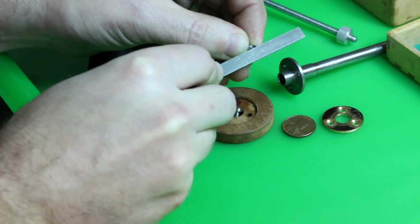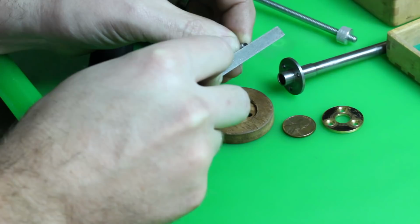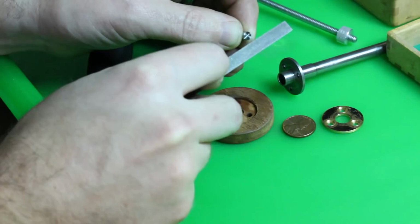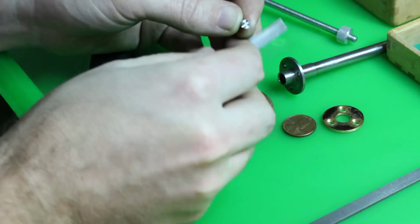A properly made slotted screw should have its slots lightly chamfered to help avoid damage from screwdriver tips that are either the wrong size or flat ground instead of hollow ground. It only takes a few moments with a decent file, just make sure the file has safe edges and that it's straight rather than tapered.